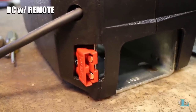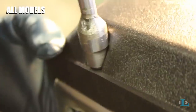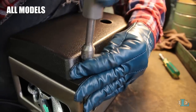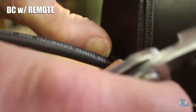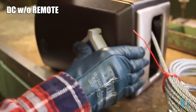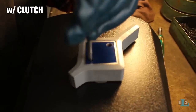When reinstalling the cover on a DC-powered winch that has a remote, be sure to fit the red connector back into its cutout. Next, get the two long cover screws and use your 3/8 inch wrench to tighten them into the corners of the gear side of the winch. Then grab the two short cover screws and screw them into the opposite side's corners. If your winch is DC with a remote, get the pigtail's bushing back into its hole using both your pliers and your fingers if needed. On a DC winch without a remote, snap the switch and harness back into place on the gear side of the winch. If your winch has a clutch, look for the biggest hole on the handle and the biggest hole on the clutch, line them up, press the handle onto the winch, then tighten both of the handle screws.